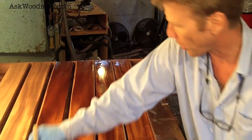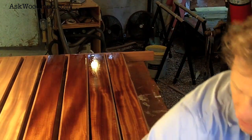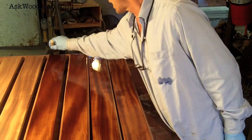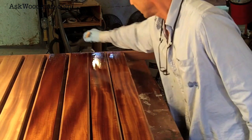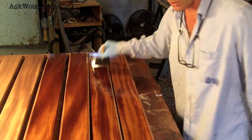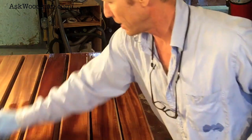I've had this sprayed and have sprayed it myself. You can't put enough on with a spray gun — I think it's probably a four-to-one ratio for spray application compared to what I can brush on. And then there's all the cleaning of the spray guns, so I just don't do it.